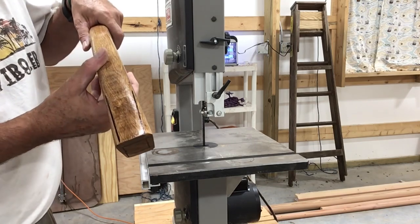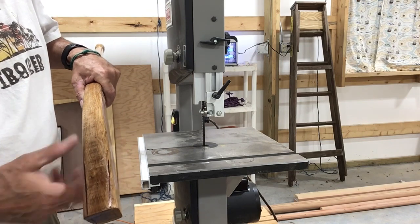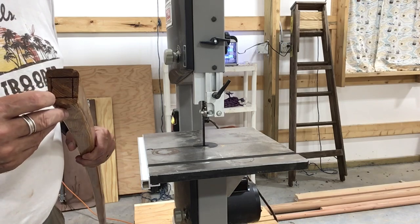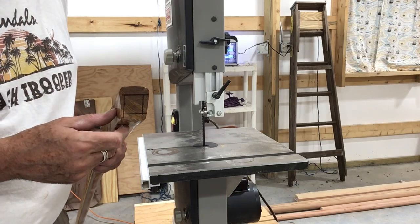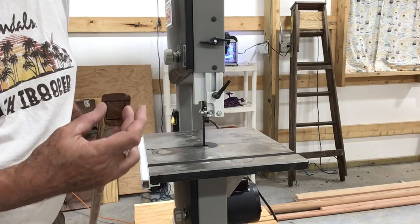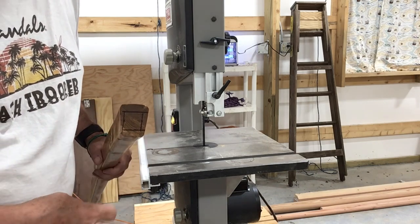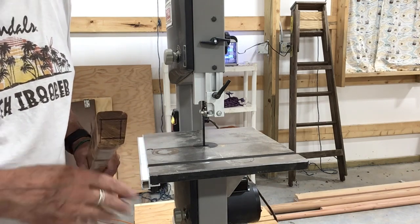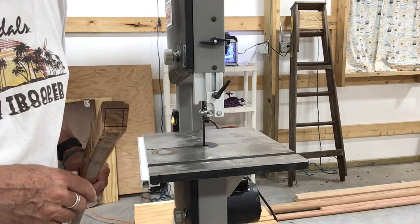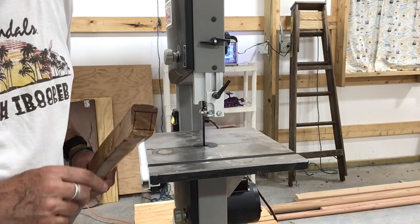I got some lines coming up the top there, and I'm just gonna narrow this out, going back through the transom and where it connects. It can only be 1 inch wide at the rudder because the rudder's only 1 inch thick. So this has got to fit where we cut out the rudder so that the cheek plates will go on the side of it. It'll make more sense as we do it. But in the meantime, I'm gonna cut this very carefully on the bandsaw and see if I can get the end of this more to a size that's closer to the plan.